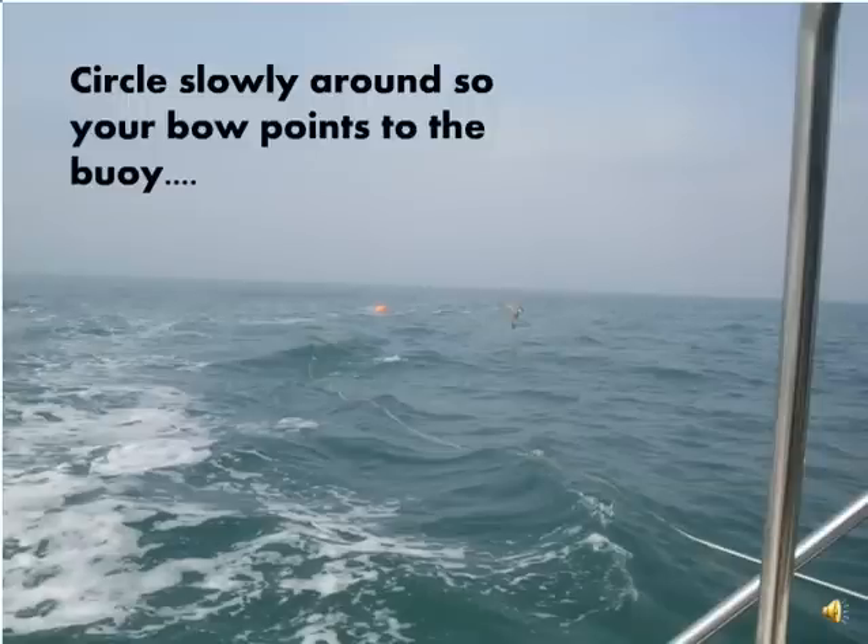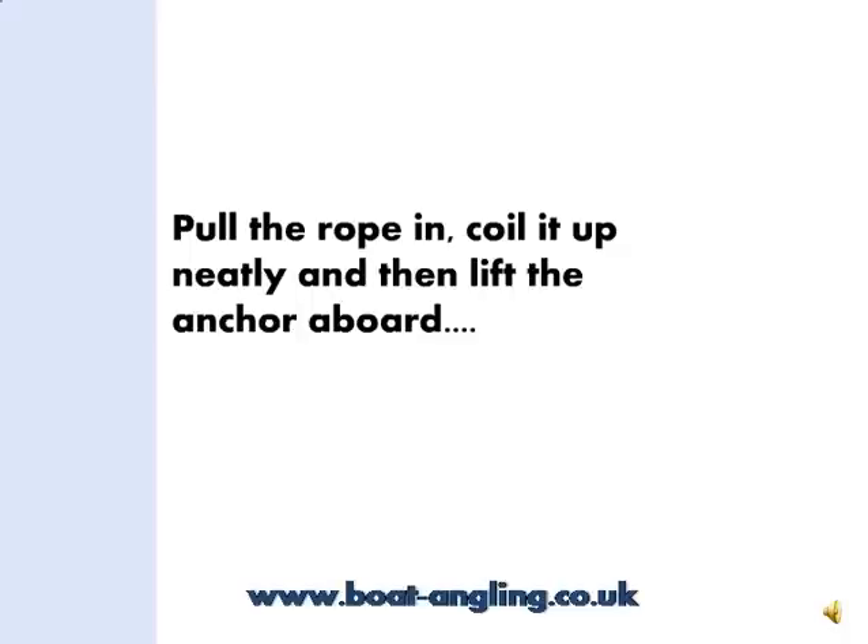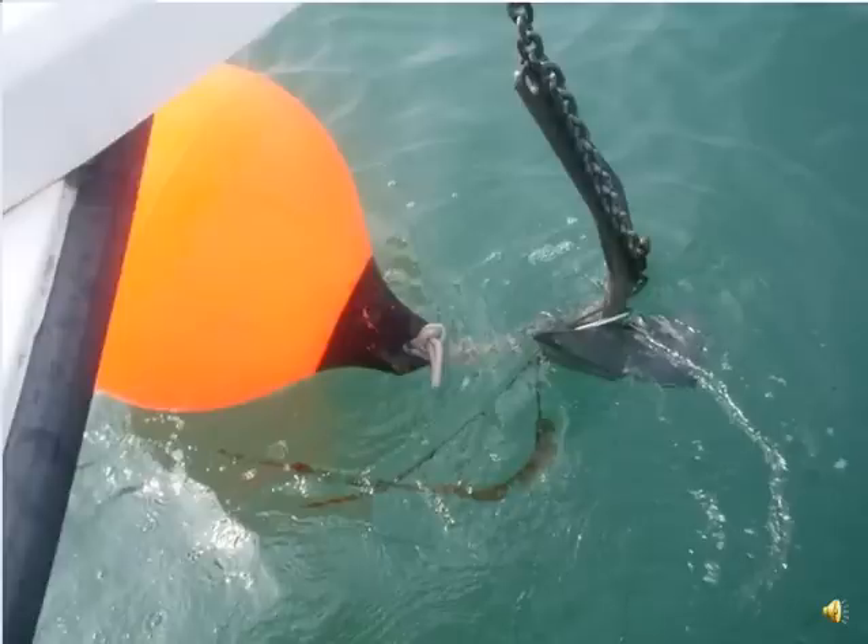To prepare for pulling the rope and anchor back on board, I find it easier to circle around so the bow points towards the buoy. If you can't reach the foredeck, you'll have to catch the rope with a boat hook and pull the anchor rope into the cockpit. The hauling process is now very easy — the weight of the anchor is now carried by the buoy and you can pull it in with almost no effort. As you pull the rope in, stow it neatly then pull the anchor aboard. The example here shows a plough anchor rigged for tripping. The ring has slipped right down the stock giving it no chance to accidentally drop back while we are pulling it in.